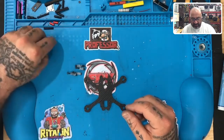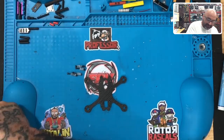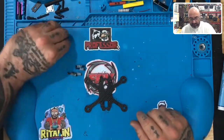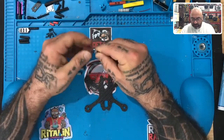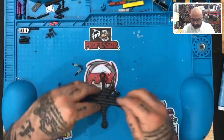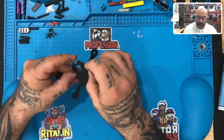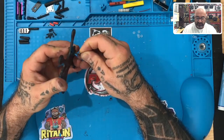I'm gonna move the AIO off the bench because I want to get started with the frame first. I'll take the camera mounts and standoffs aside. You will also be getting eight M2 8 millimeter screws which go for the bottom and top plate. First thing we want to do is take the 20 millimeter M2 screws and start installing them. The inside circles are 16x16, the outside circles are 20x20 — we're doing a 20x20 build. Put the screw in, take the fastener, and go ahead and fasten that screw down.